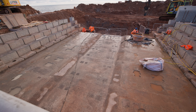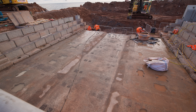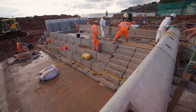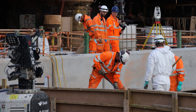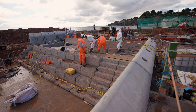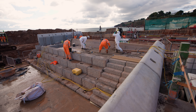The centre of the spillway is angled so that at low tide it diverts the water into the middle of the stream. On some very high spring tides this is going to be pretty much filled right the way up — you know the tidal range you experience down here. On either side of the stilling basin there are stairs to go down into it for maintenance and access, with hand railing along the side. Along the edge beam in front of us there'll be another set of stainless steel hand railing running right the way down, similar to what we've put across the rest of the wall. The guys on the right are putting the structural slabs on the back of the step units, which links all the step units together at the back so they act as one big unit rather than individual units, tied together with reinforcement. The fencing will be installed along there to prevent people from coming down to the units.